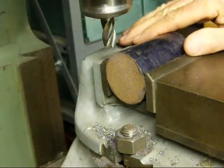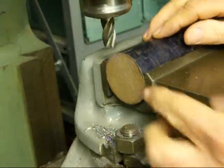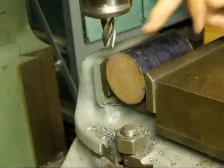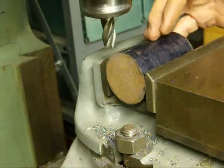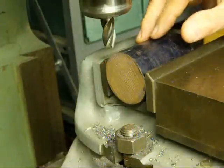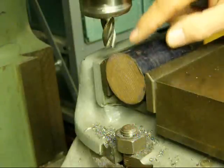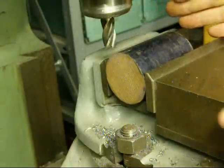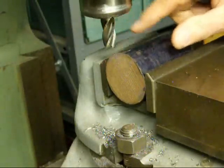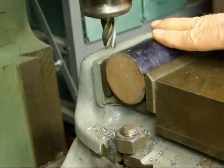Over on the Bridgeport Mill now — if you've got a milling machine, all your problems go away, and there are two different ways of doing it. One is to hang the piece out of the vise a little bit farther and use your center finder, and you can quickly find the true center to a thousandth of an inch of any piece of round stock. That takes several minutes and requires the right equipment, but it is the preferred method. Another way is to put some bluing on the work and take ever such a light cut, and wherever you have cleaned it up that is going to be the very center of the work. Then you move the vise out of the way, center punch it on that little flat spot, always start with a center drill in the milling machine, and then go ahead and drill it. That will work really well because nothing moves when you have it clamped down in the milling machine.